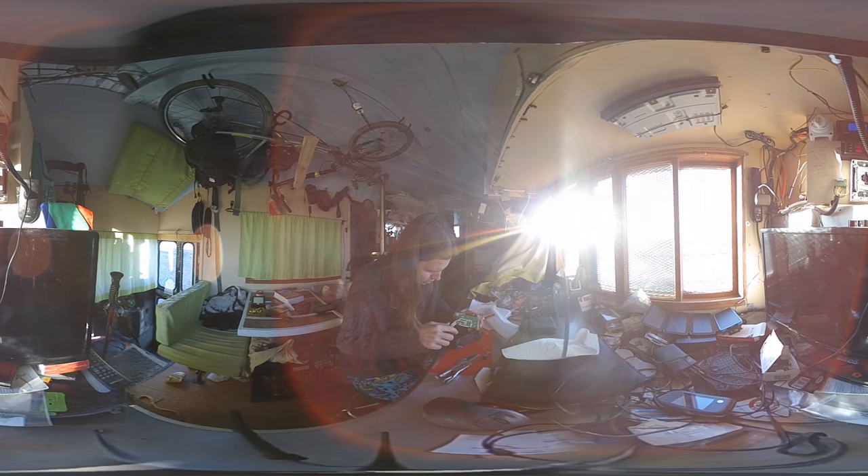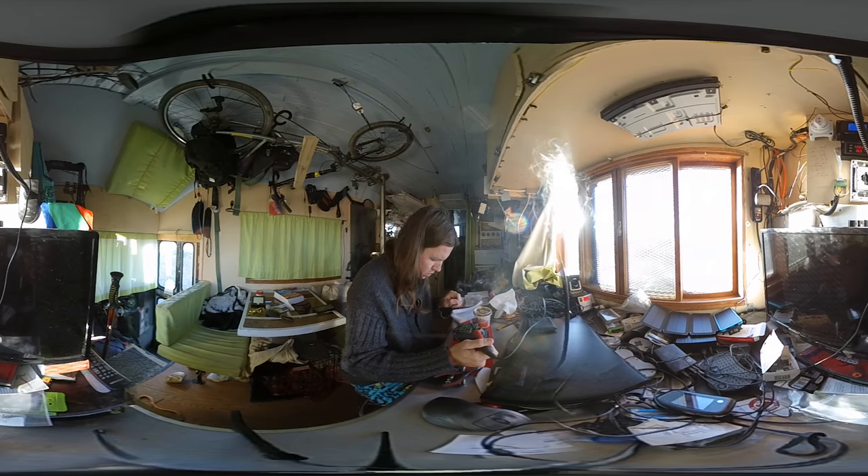Usually if a joint moves and looks good, it's a bad connection. You know, bad connections are also known as opens. There's not too much — sometimes you can have a partial connection, but most faults on electronics are either shorts or opens. There's a questionable joint right here, and similarly on these two down here — looks like they got too much solder on them. There are several videos on YouTube about this, but I'll just touch these up.